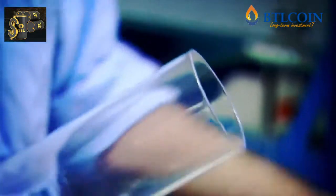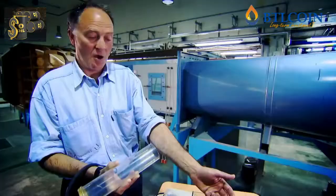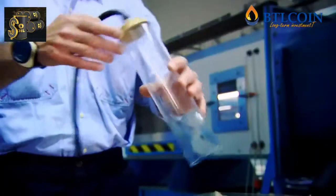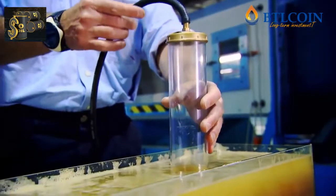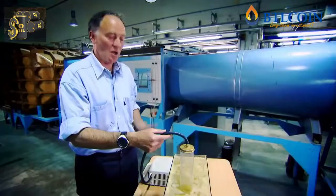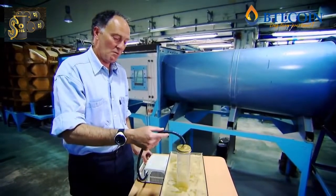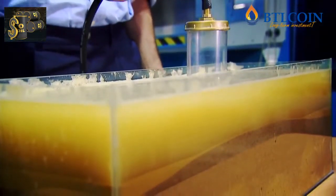If I turn on this vacuum pump, you can see it creates a suction. So I do the same in the water. If I place it on the ocean bed, which this represents, initially it only goes in to its depth under its own weight, so it's hardly getting into the ocean floor at all. But as I pump out the air and the water, it draws itself down into the ocean bed, creating a firm anchorage.